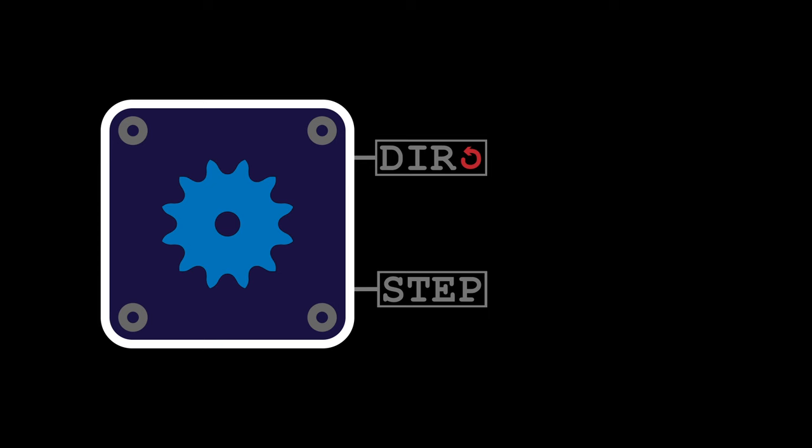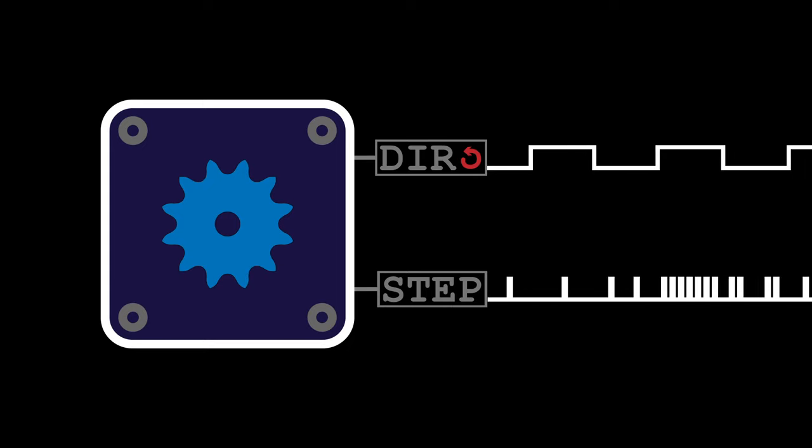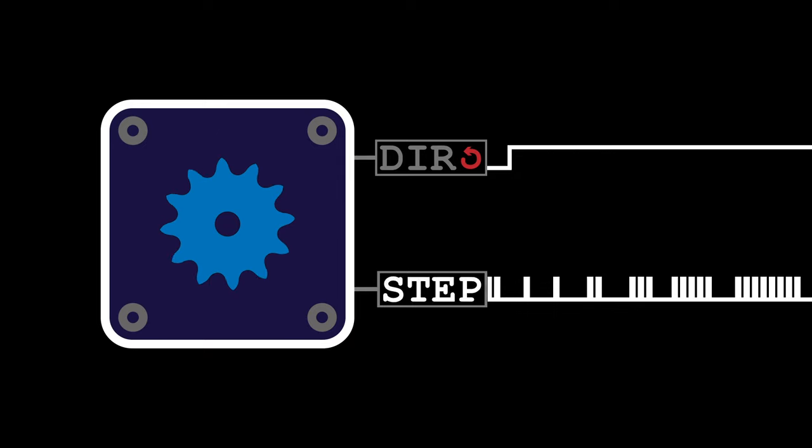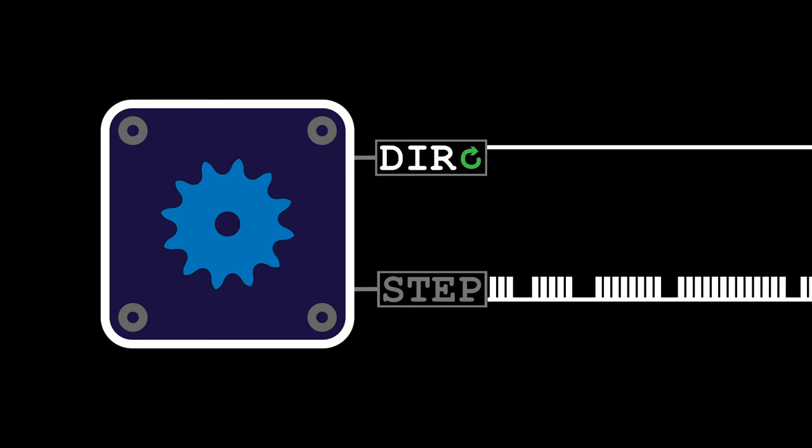This means setting one line high or low to tell it the direction, and sending a pulse on another line to tell it to make a step. That's it. The driver electronics are just there to safely deal with the current needed to drive the motors without frying the microcontroller.